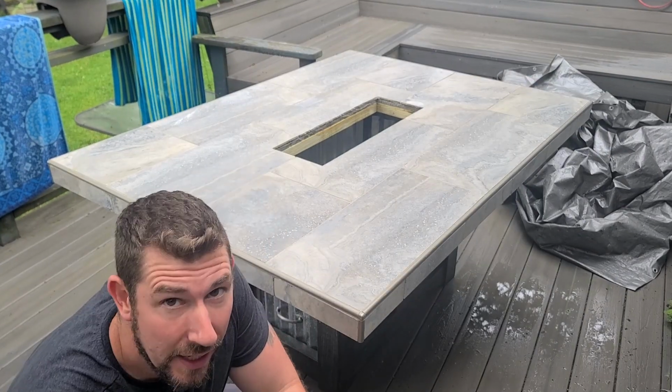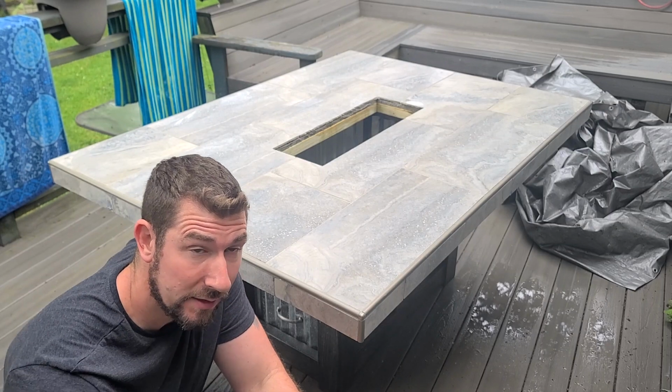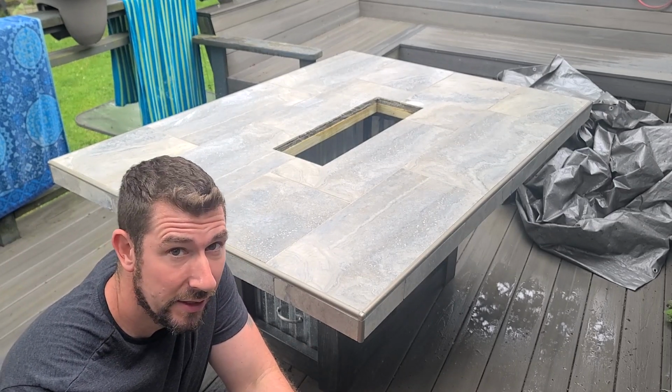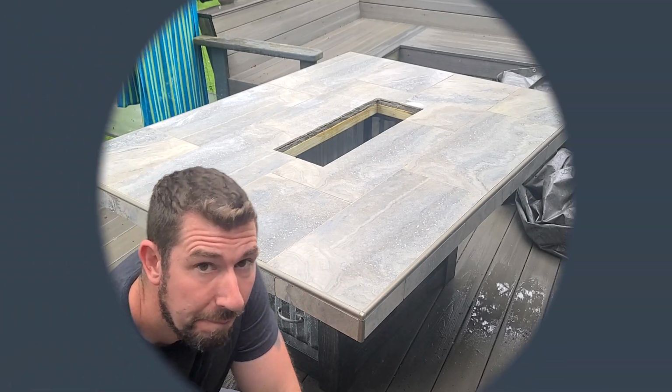All right, so we're gonna let that haze over again. We're gonna change our water out, come back with clean water for the next time, and just keep repeating the process until your tile is completely clean and shiny again. And then we'll wait 24 hours and seal it.